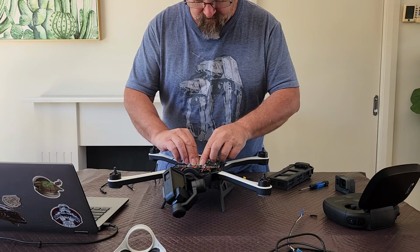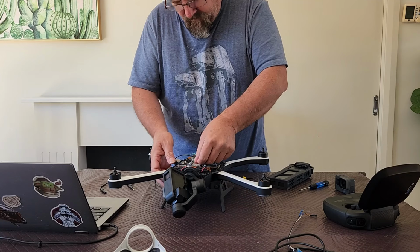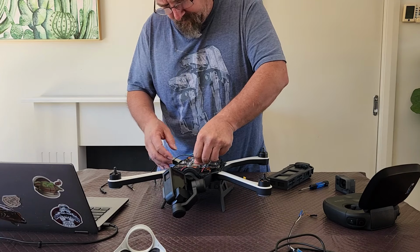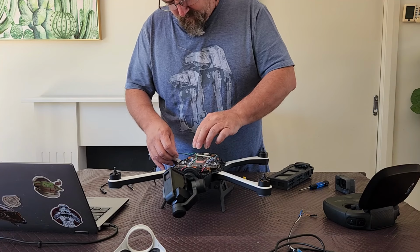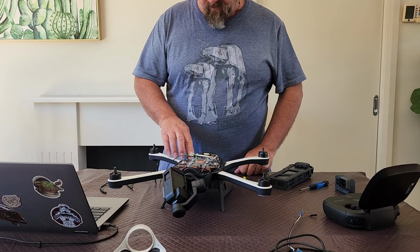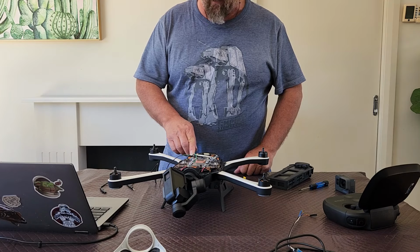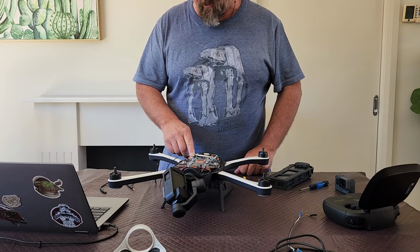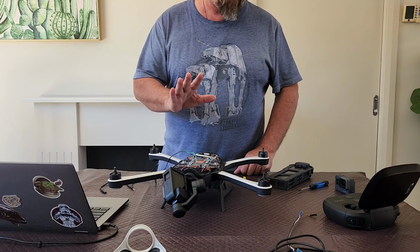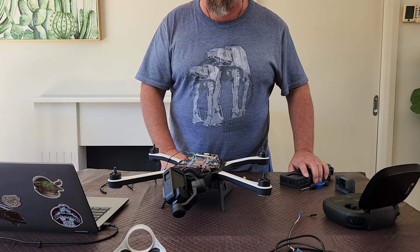It's simply, just slide it back on and then just push it down. Make sure it's down everywhere. I need to desolder these wires, and I need to put a little bit of silicone on this connector to make sure that it doesn't pop up in flight. So, silicone on the connector, remove these two wires. I can put the cover back on. It's exactly the same as you took it off, just those six screws. And that's pretty much ready to go.